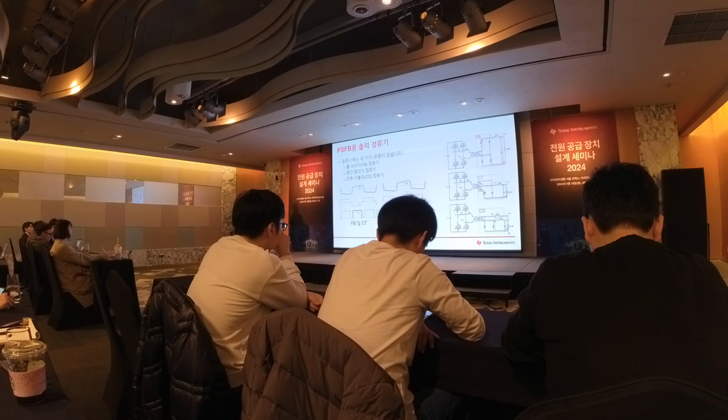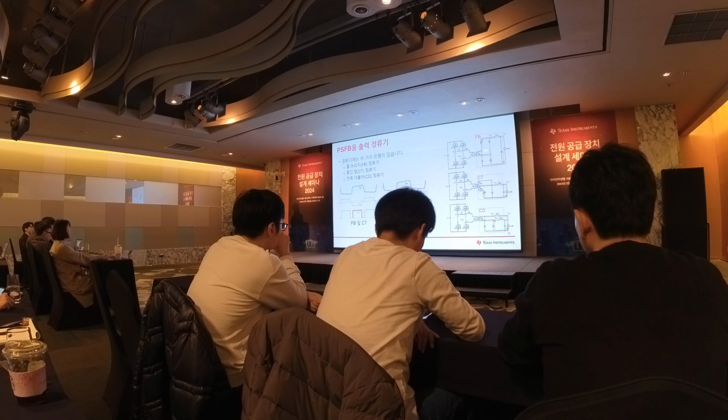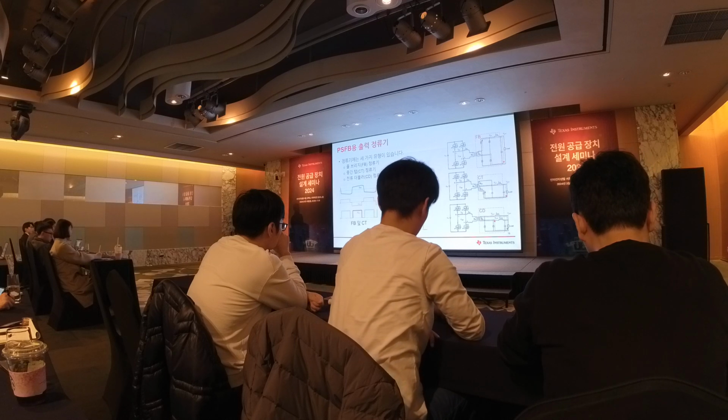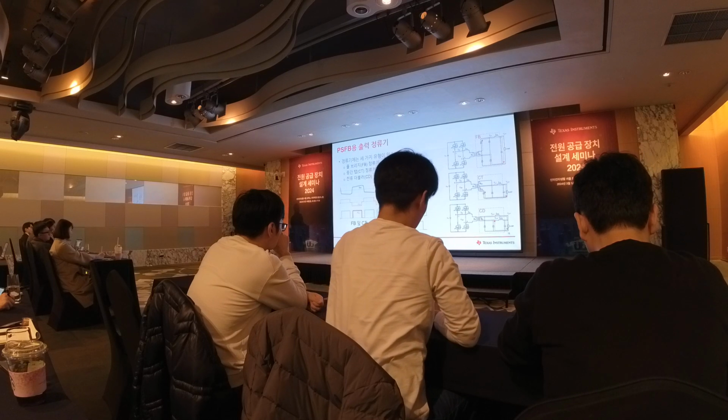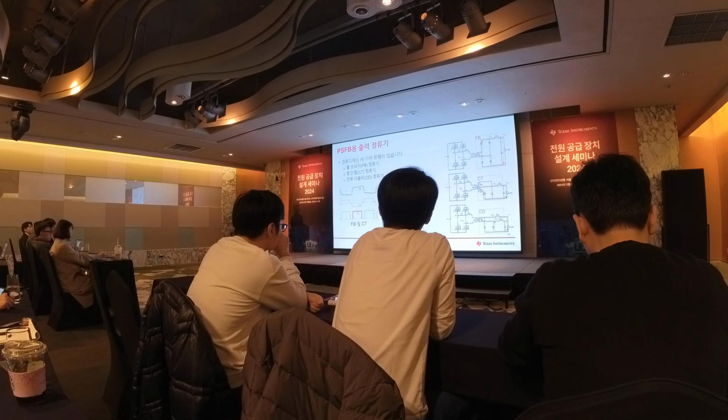When the VAB voltage is negative, then for full bridge rectifier, it will conduct current through the other diagonal pair, and for center tap, you will conduct current through the other winding. While in current doubler, the current will be conducted through the other output inductor.